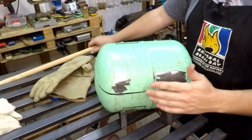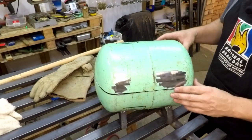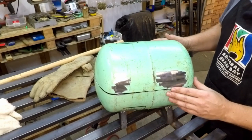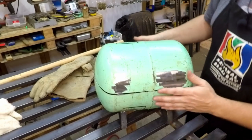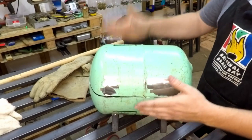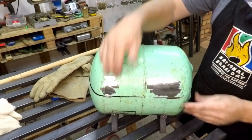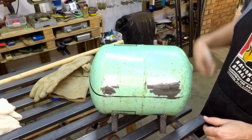The reason for screws is that if I want to paint or clean it, or if the wood starts to go bad or damaged over time, I can unscrew it and replace it with a new piece. To summarize progress: the foot pieces are welded in place, the hinges are welded in place, the lid is now operational. Next is the handle, and after the handle we'll take it further.